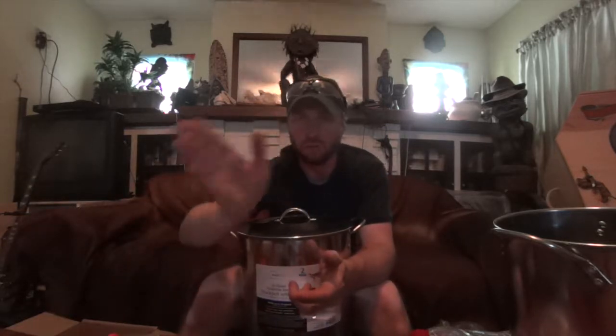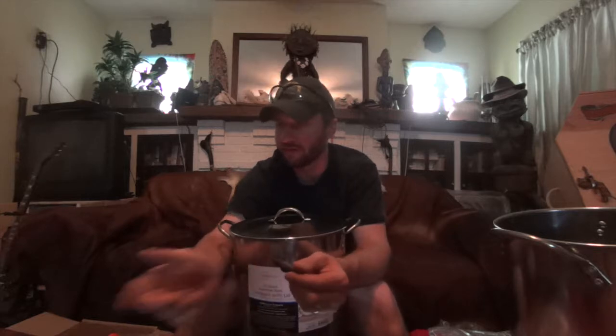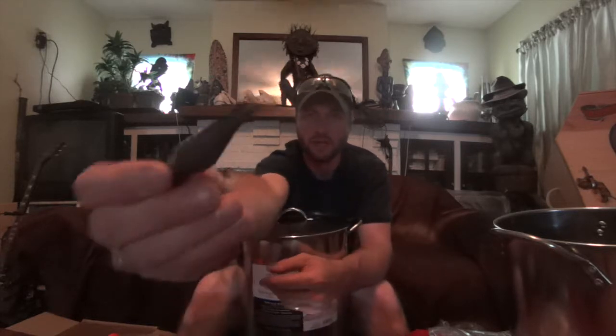Some do both ways. They're straight, they're a little harder. So I would highly recommend when you're going through metal, get the right angle that you are familiar with. Me being a righty, I'm more comfortable going to the left. That's what we're going to use today. Step bit is going to drill the center hole for the water spout, which will be in the middle. I'm going to mark it roughly.